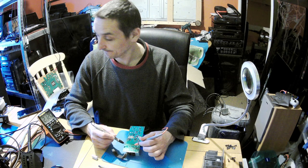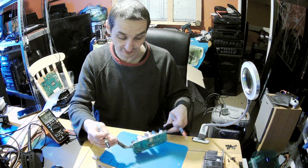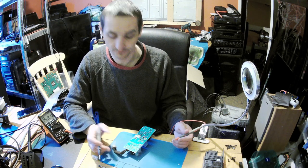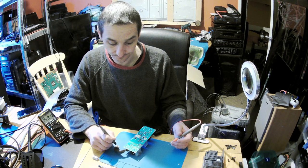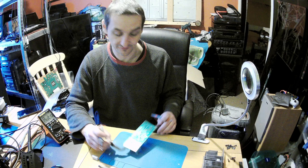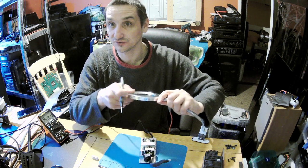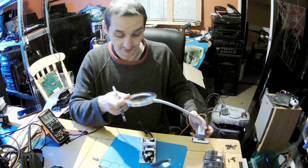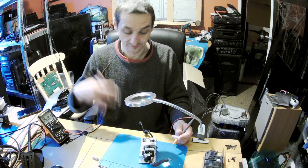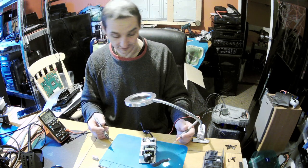So, either something is creating us a short, and that short is causing the transformer to not work, or the transformer is faulty. Yes? So we don't know that. Now, the question is what to do, because we don't have schematics, we don't know the efficiency of this transformer, what is the winding, primary, secondary winding. It's a high frequency transformer, that's all we know, and we know that it's supplied with 340 volts, okay, so then it's step down, it's going down, and it's 1-2 watt, so it's still under the power.